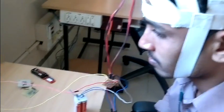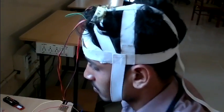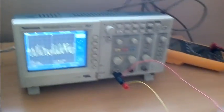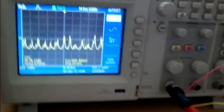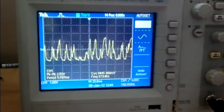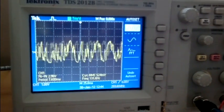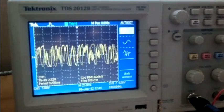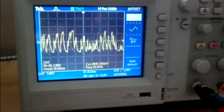This is the demo of our low power portable EEG. Here we are showing the signal amplified by the active electrodes without any filtering. This is the signal received from the active electrode without any filtering. The 50 Hz power line noise is interfering with the signal significantly, so we will have to filter this in the digital domain. This is the direct analog signal shown on the oscilloscope of the individual whose brain signal he is currently recording.